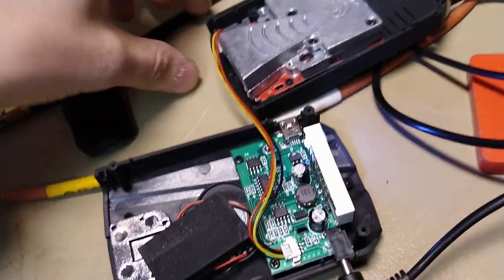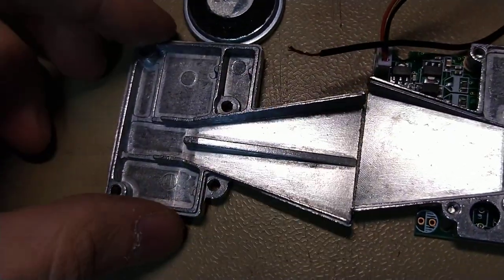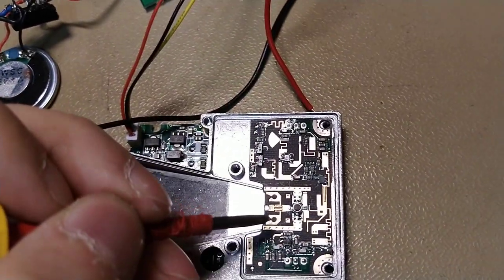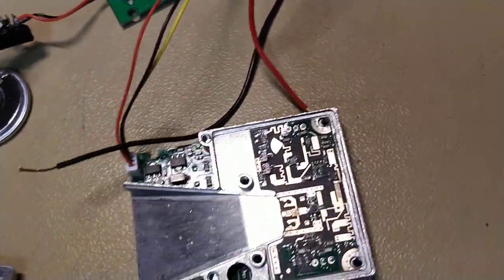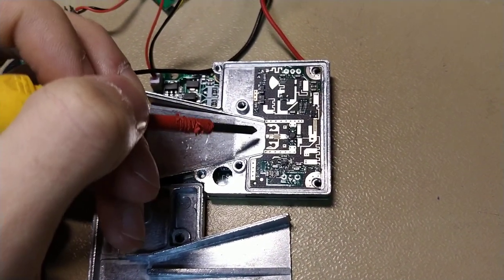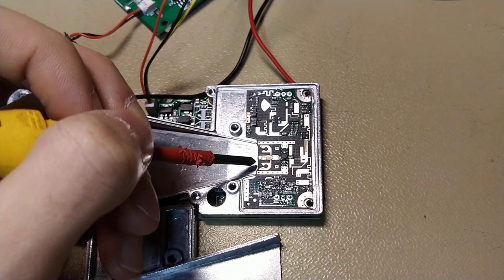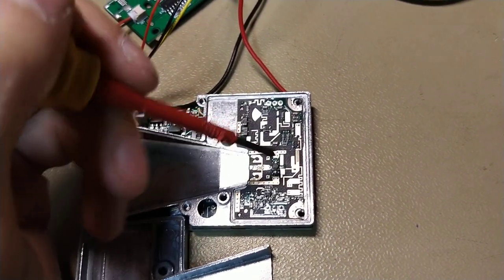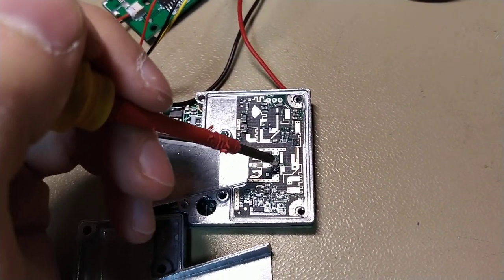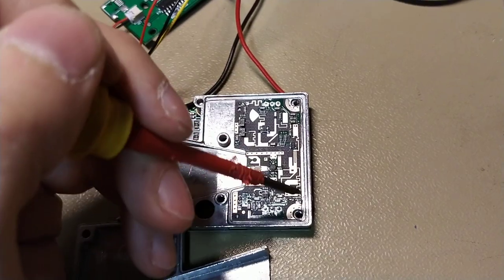So if we take a look at the older one, we can see that there is a ridge inside the horn, and it's just pressed so that this part of the ridge contacts here on the microwave assembly. The ridge is likely used for the 10 GHz X-band stuff and 24 GHz K-band stuff. The feed points here are likely used for the Ka band, and there's some attempt at bandpass filtering. There's some HEMT or GaAsFET chip here. We have a low pass filter for some frequency, likely above 2 GHz or some below 2 GHz or so.